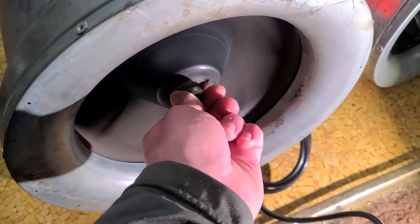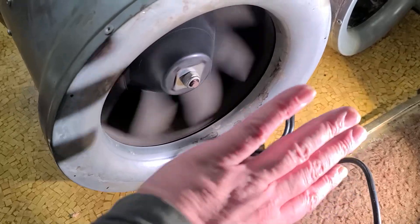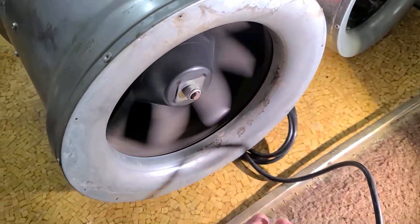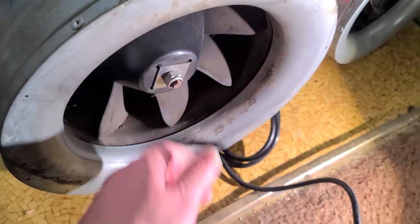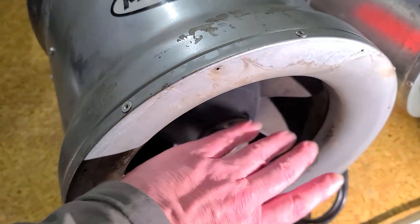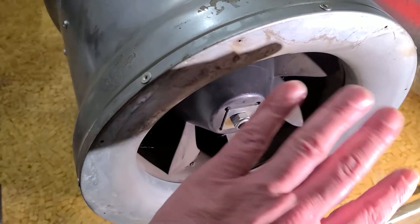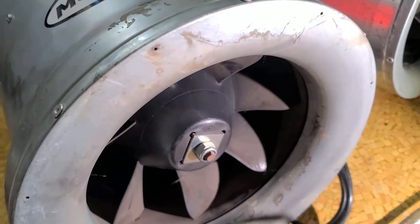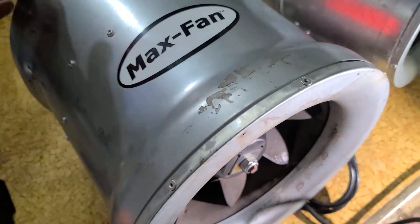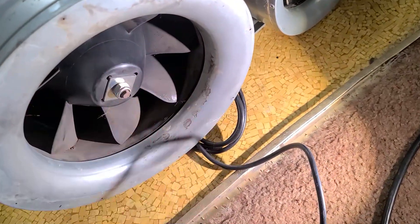As you can tell, it's pretty loud. I've seen somebody do this once on bigger fans — put their hand in front to feel the suction. Never ever put your hand in front of any type of moving, operating fan. You get your hand to a certain point and the pressure gradient is exponential — you'll have like four times as much suction force, and your hand can just get sucked right in. Even though these are plastic blades, there's a lot of mass in there. If you want to feel a fan, you have to feel the exhaust unless there is a wire mesh in front of it. Just wanted to put that out there because I've seen somebody do that.